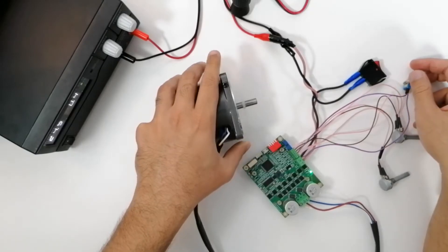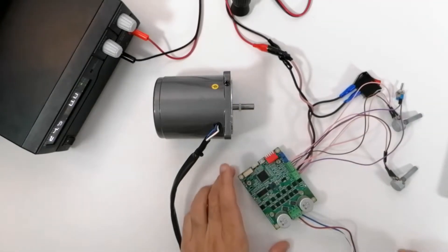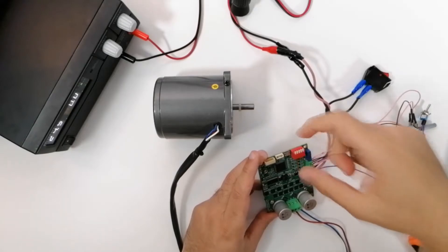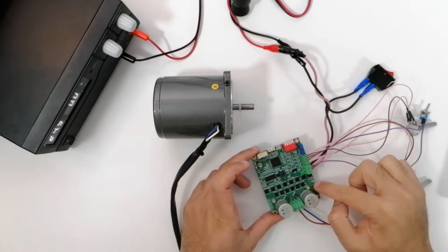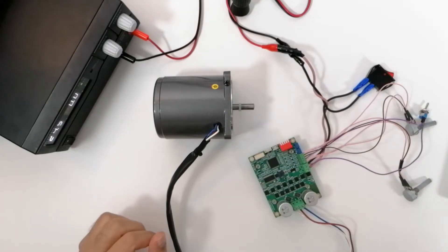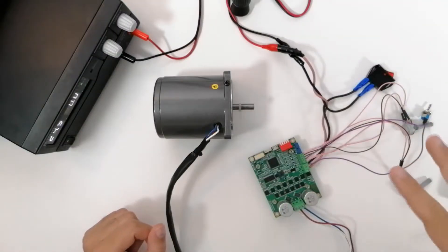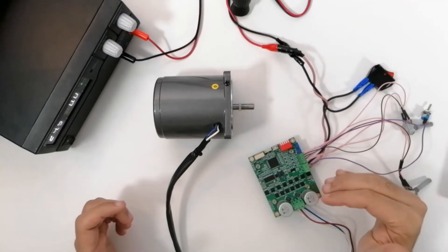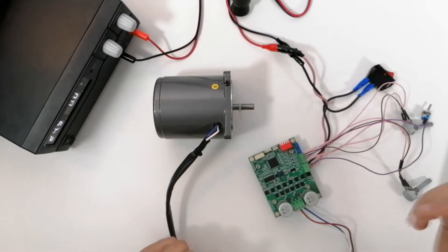Now I'm going to explain the details of what's happening here — what I did to control this motor and how you can do the exact same thing to control the speed of the AC induction motor in a sensorless manner. The wiring is pretty simple; I've done the simplest wiring using only potentiometers and a switch. You can use an Arduino instead of these potentiometers, and instead of sending analog voltages you can send PWM pulses. We have a lot of blog posts regarding this type of control on our website with Arduino examples.